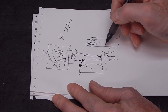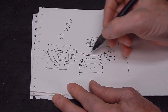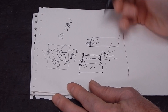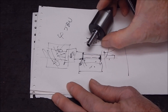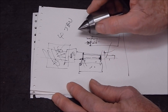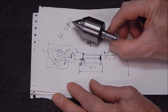The odds are it'll pretty much fit straight off, but as I said there could be a slight variation, and you just adjust it out. You machine through until you get it down to the end measurement, and when both end measurements are where you want them to be, you're done. It's as simple as that - and it'll be dead accurate. When I did this it became absolutely perfectly accurate. If I put this in the tailstock, measure it off on the tip, rotate it a quarter turn and measure, it's the same reading all the way through, which shows the taper is absolutely spot on.